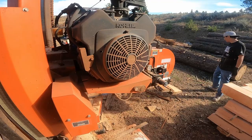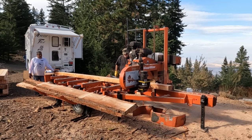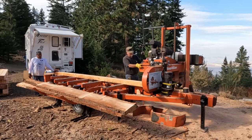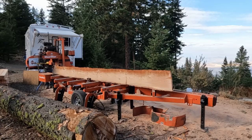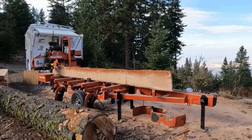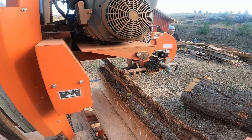So I don't know if you noticed, I kind of came in above the pith and then came back, drove it down and took a board out right there. So I'm going to keep that center, that heart, the pith in one piece of lumber. So it's not perfectly centered, that would be ideal, but at least it's in that one piece. If that piece kind of twists, warps, cups a little bit, it can either be edged down on a table saw or can be made into firewood, but it's just one piece, not a big beam. Not multiple pieces, and that's okay.